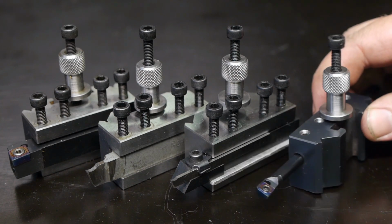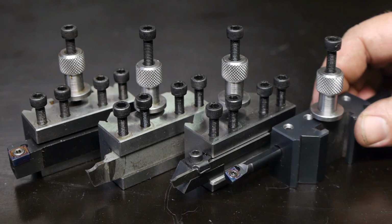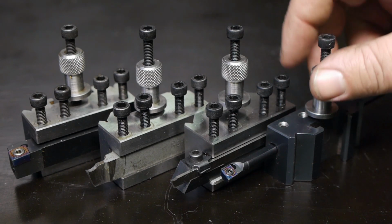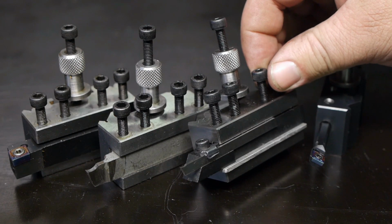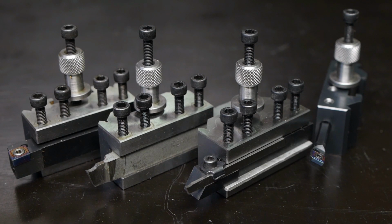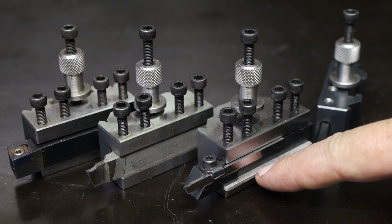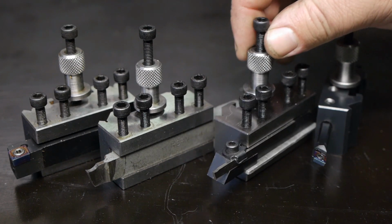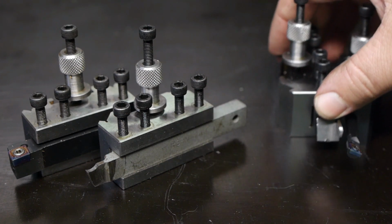Here is the modified parting blade holder, and as you can see, it now holds a small boring bar. This here is a tiny parting blade sitting in a regular holder, and I'm hoping it will reach up to center height. And to improve my odds, I've installed a couple of shims. Actually, it's only one shim. It made me feel a bit nostalgic for the 4-way tool post holder.